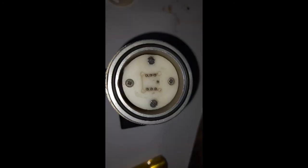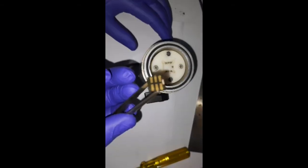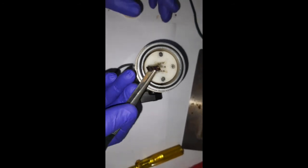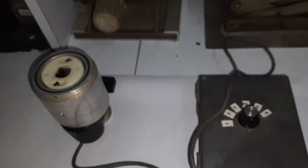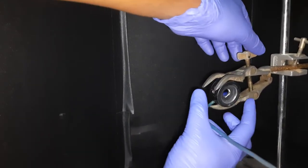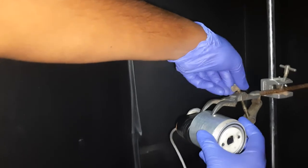This is our solar cell. It consists of six individual cells. We place our solar cell into the sample holder. This sample holder is connected with a switch box in order to make individual contacts with each of the six cells. Now, we need to place the sample holder at the position where we placed the calibrated photodiode.